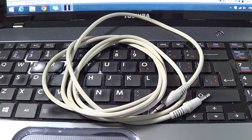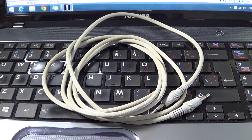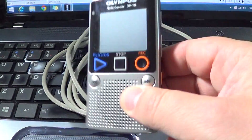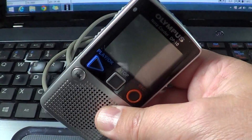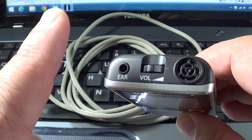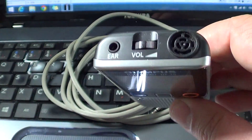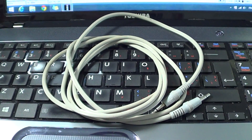Lots of cool little MP3 recorders are available and they're really cheap now. For example, my little Olympus recorder — this is an MP3 recorder. You can record your digital signal on it, hook up the little wire to the earphone jack into the computer, and decode from there. So if you have too much noise, this is a great way to work around it.